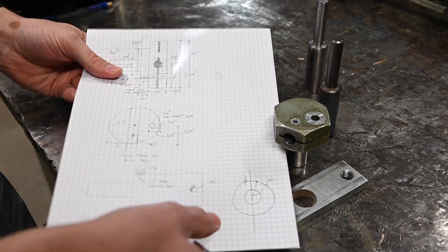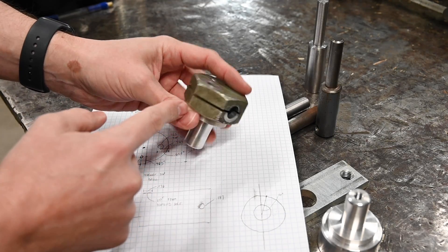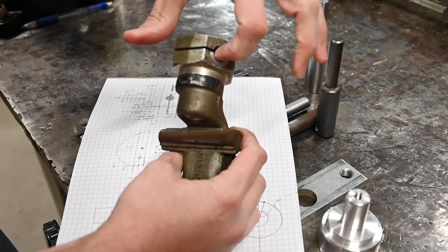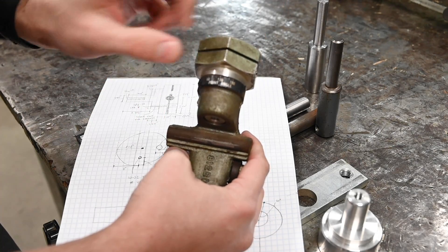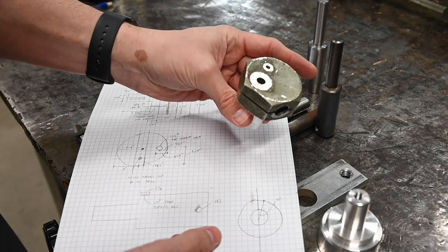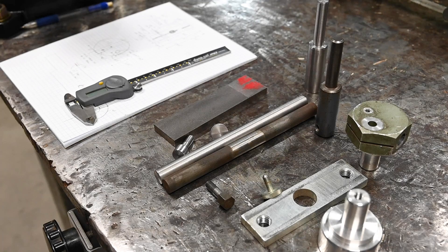The difficult one of course is going to be this turret, and I'm glad I took the time to sit down and make all my measurements, just because of how many features there are and they have to be in time with one another. When you're operating the machine, there's an index mark down here that references against this indicator for the point angle, so you've got to have that correctly oriented to where the drill carriage goes — otherwise you'll grind the wrong angle on your drills. The bore that goes through the part is very important. I've also got a couple of parts on order from MSC, and we'll get this wrapped up hopefully in the next few days. Thanks for watching.